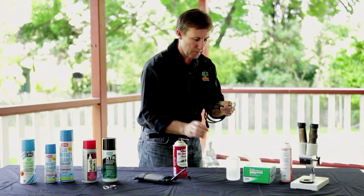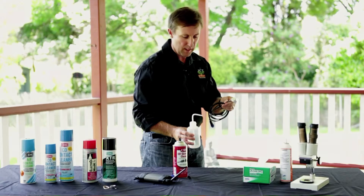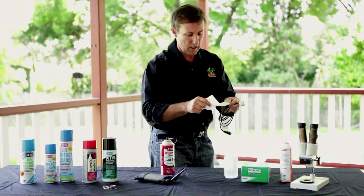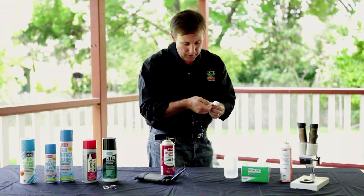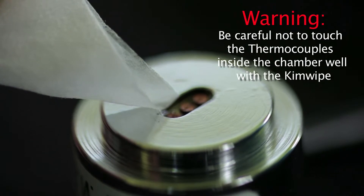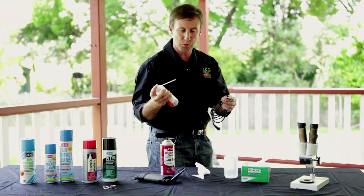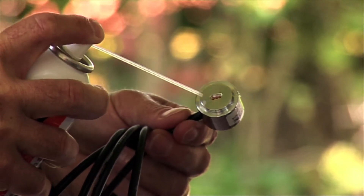On the final pass, just tip the chamber up and quickly, before the contact cleaner evaporates, rinse and flood the well with distilled water. That ensures that any contaminants dissolved by the contact cleaner that may remain in the well are rinsed out and don't resettle on the thermocouples. Then take a kim wipe, fold it in half so you have a nice firm corner, and place that kim wipe very carefully into the corner of the well. Allow it under capillary action to wick the free water out, then use the compressed air — which is dry and doesn't have excess water that would contaminate the chamber — to blow the last remaining molecules of free water from the well.